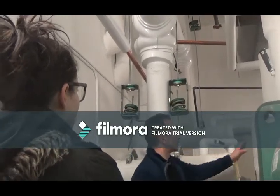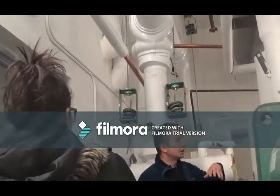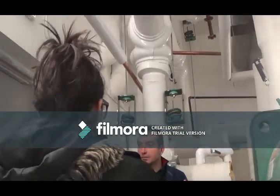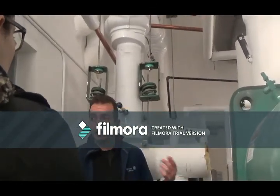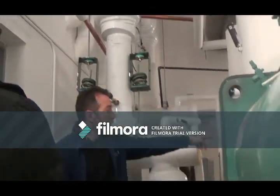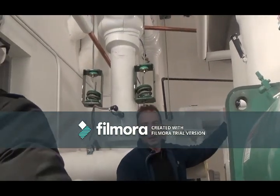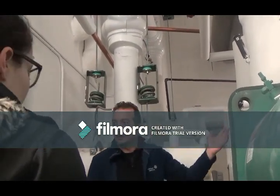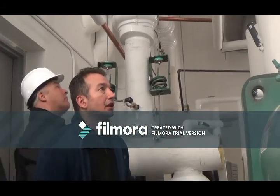They gave you some gauges on piping on there. For this system here, it's going to be a consistent pressure. So it's not a bad idea, if you're doing your rounds, to mark on there that this one's always, let's say, at 40 and this one's always at 50. If something's changed, then what's happened? Did the water pressure drop? Did we lose water and so forth? So you're looking at your gauge to see that they're correct.